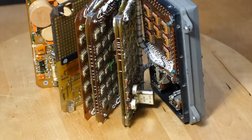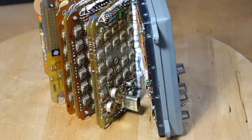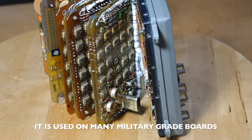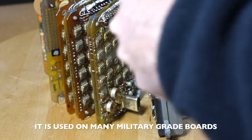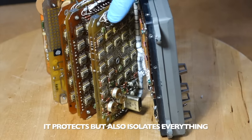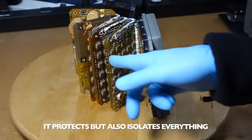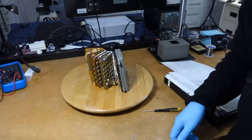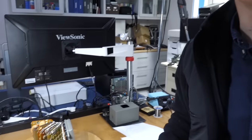And it's conformal coated, so how do you probe it? The conformal coating provides a problem. I've been using probes with pins on the end, so I can poke through the conformal coating with the pin. Also, the conformal coating isn't on the top of the wiring harnesses or the underside of the ICs, so I can get some access without having to go through it. So far, we haven't had to disassemble it more than this.